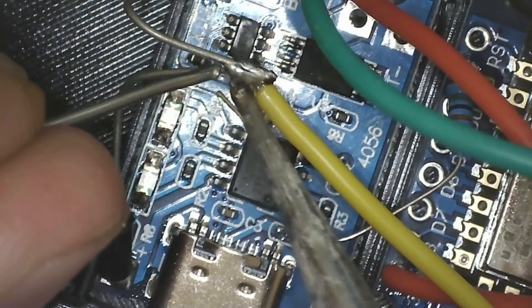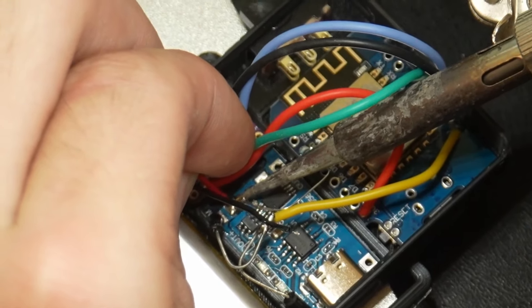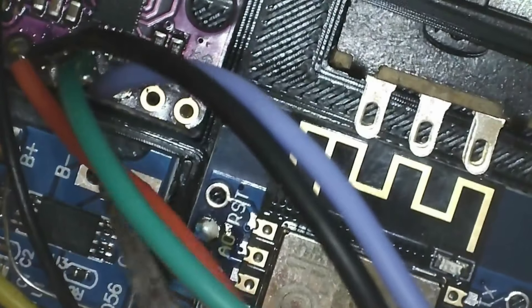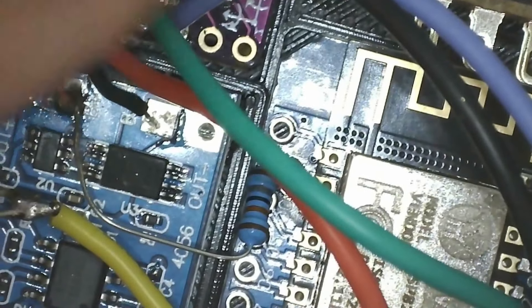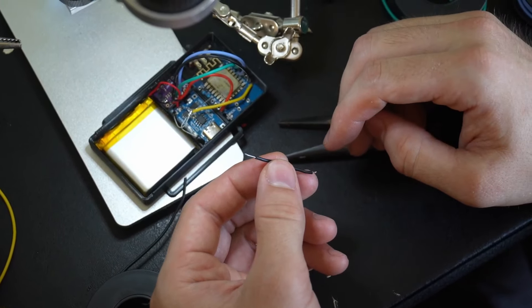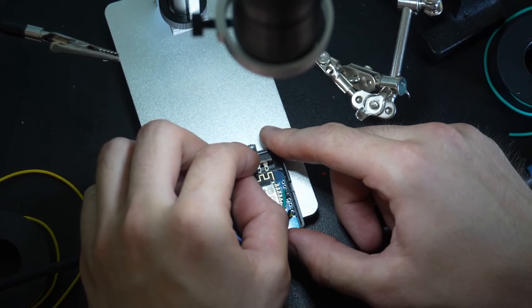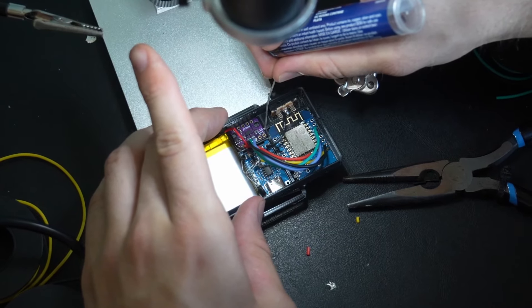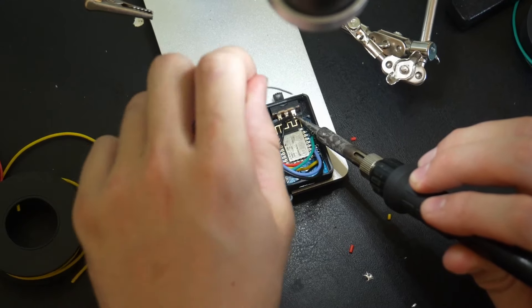Lastly, it's time to place the battery into the case. Then we're going to take that resistor that we put in earlier and attach it to the B+ right next to the diode that we put in on the charger board, as well as put the positive for our battery in the same port. We're now going to attach the negative of our battery onto the B negative port on our charger board. Next, cut yourself a short strand of negative wire to go from our control board over to our switch. This is going to attach right next to that wire we just put in, then wiring it through, it's going to go onto the middle prong of our switch. Lastly, we're going to take the last port on our IMU that we grounded out earlier — our SA0 — and attach it to the far right prong on our switch with another short run of negative cable.